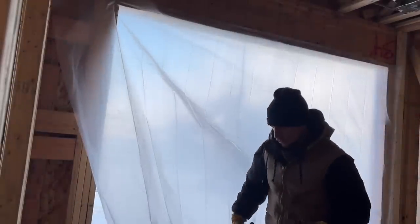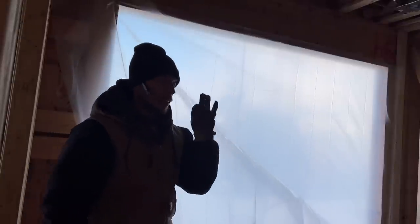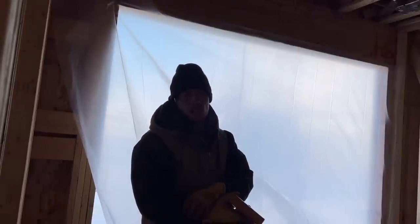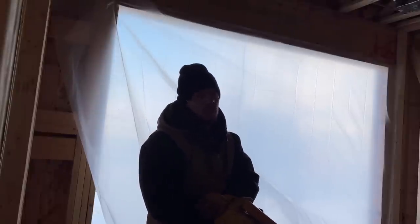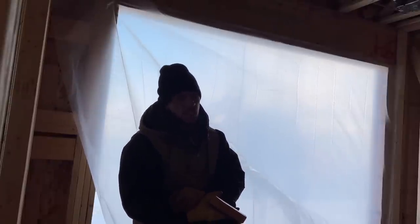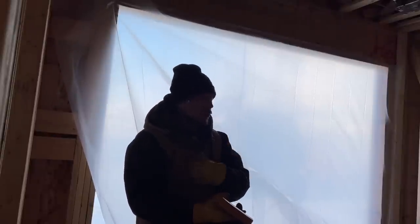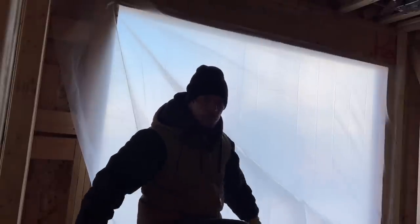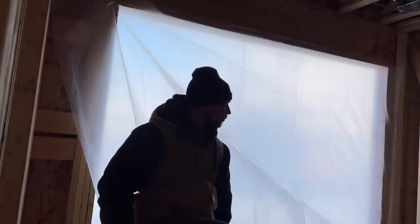Now, I know somebody's probably thinking, Joel, why not just Tyvek the house and seal it that way, because you have to wrap it anyway. Good question, class. The house has to have a shear inspection where they'll come and inspect all of the nailing on the house to verify it's okay. And if you put the wrap on there too soon, they can't do that. They'll make you tear it down and then you'll have to redo it. So I don't want to put the cart before the horse on that project, but since I have leftover Visqueen from our vapor barrier underneath this, it's gonna work perfect.